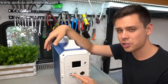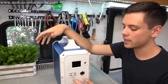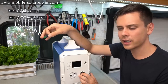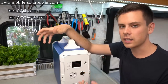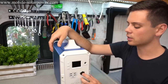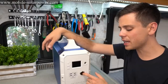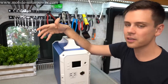It does not have quick charge USB. It has USB-C which is great, but it doesn't have the QC ports I like to see. Also the cigarette lighter output is regulated at 12.3 volts — the Jackery is the only other one that regulates it, at 13.2 volts. At half state of charge the Energy Apex drops to around 10 volts, which really hurts 12 volt appliance performance. This unit stays regulated, but I wish they'd done 13.6 volts — it would handle loads better in every way.